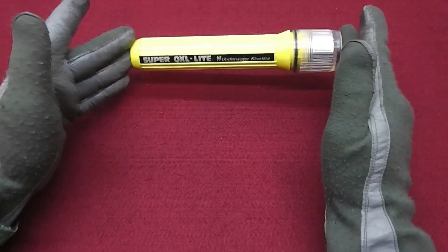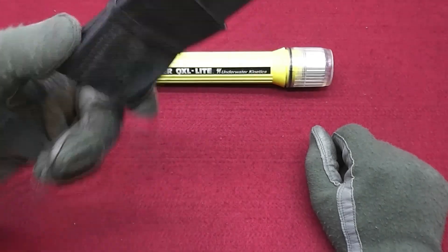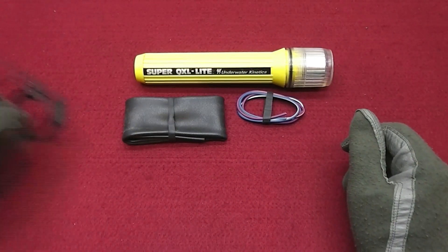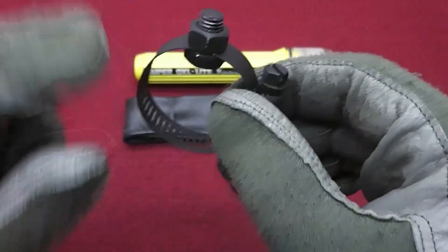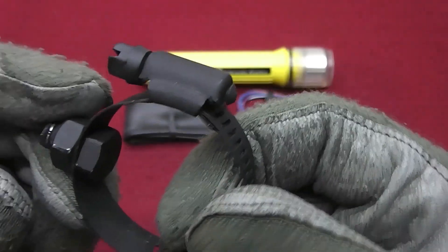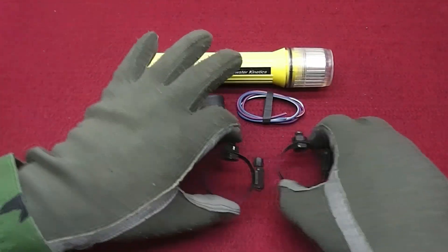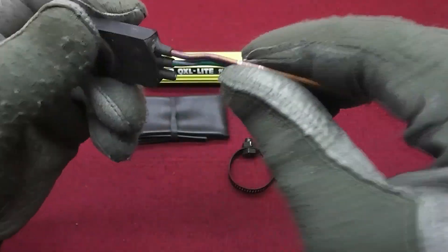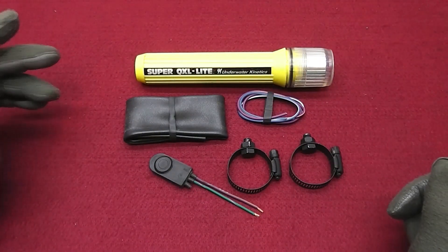In order to make this conversion we will need: the original QXL dive light, some rubber inner tubing, vintage wires as used back in the day, and two hose clamps. I've already prepared these hose clamps — they are stainless steel, drilled with a bolt and nut inside. The clamp type is the correct one as seen in many reference pictures. This one is painted and ready to go. We also need this switch — an all-original panel black waterproof switch.